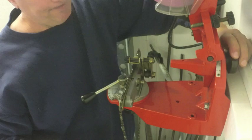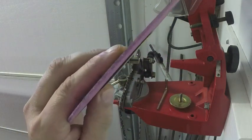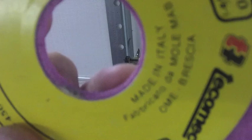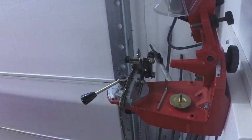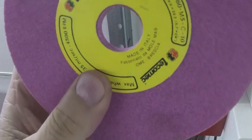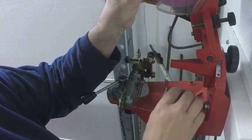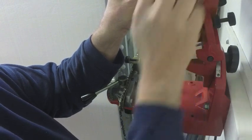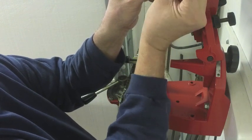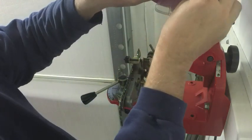Then you just go straight down on them. I'll change the wheel. You can kind of see the way the wheel that I use — it's a little bubbled. I'm going to change to this wheel which is square on the end. This is for the rakers and heavier chains, but this will straighten up the depth gauges. Actually, I'm sorry — not ten thousandths, twenty-five thousandths is what you want for the depth gauges. So I'll put this wheel on and we'll grind the depth gauge.